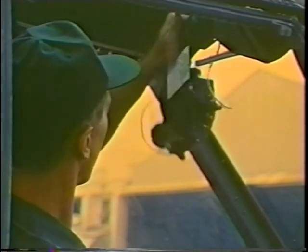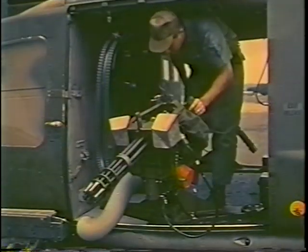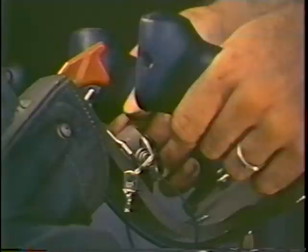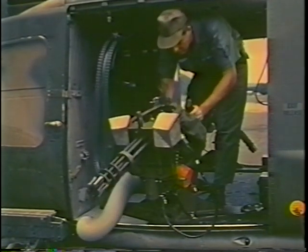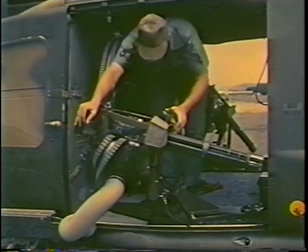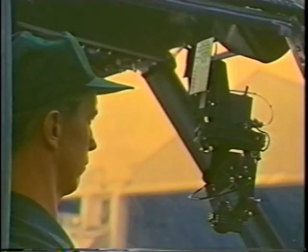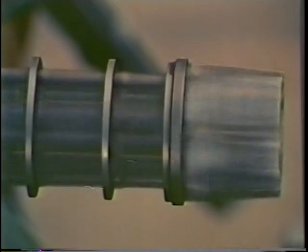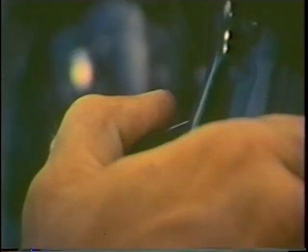The armament system is simple but effective. The rocket gun sight folds down in front of the pilot as he prepares to fire. If a gunner gets hit, or if the pilot can more easily fire along a trail but wants to estimate where the rockets will impact, he uses the forward fire position. In the forward fire position, parallel to the axis of the aircraft, the guns are locked in this position, bore sighted to the pilot's gun sight. The bore sighting is done after the equipment is installed. The change from side fire to forward fire position can be made anytime.